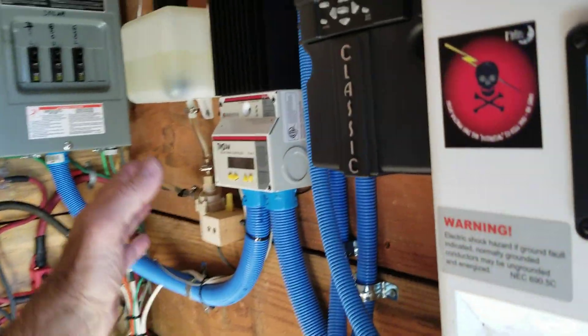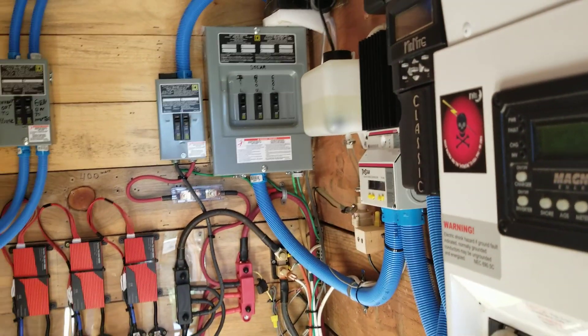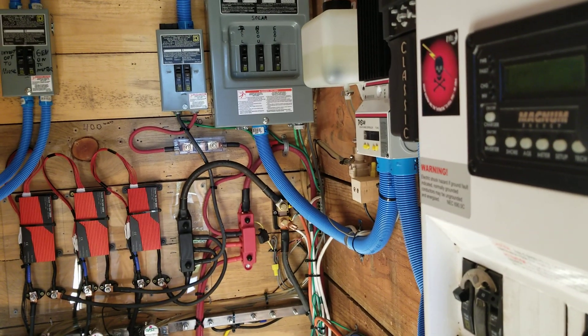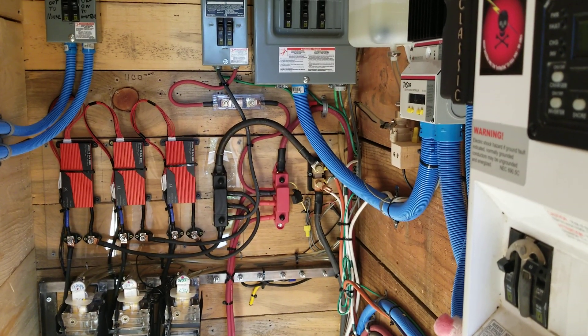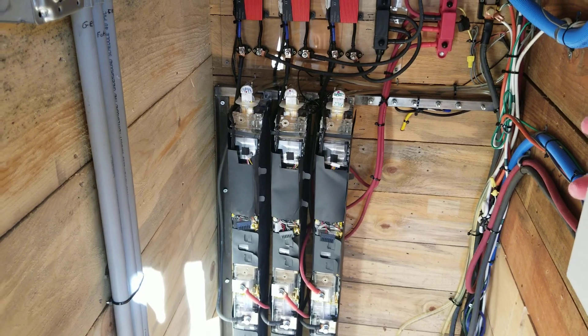It's the 27th of October today. We've got clear skies, cold weather — but clear skies that won't last forever. I'm sure we will see some generator time at some point. But one thing I've noticed is I've come up here for five and a half years and looked at all of my charge controllers, added them all up, and I've been running at 6.5 to 7 kilowatts per day — five and a half years, like clockwork. And now I'm five or under. The only thing that's different is the lithium ion, so that's telling me I'm saving two kilowatts a day. The only thing that could explain it would be the efficiency of the lithium ion. Let me know if anybody else is experiencing that, if you have any numbers to share.